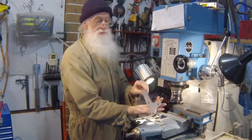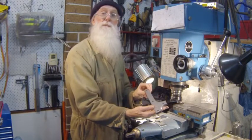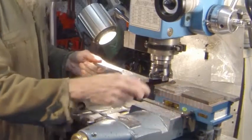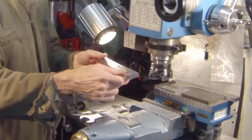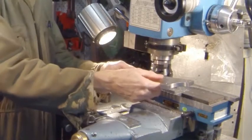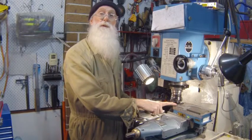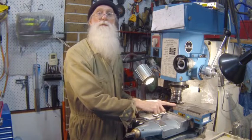As this face is already milled flat, I lapped them on each other with a bit of lapping paste just to make sure any burrs or high spots were taken. Then I just place it on the magnetic chuck, clamp it down, and mill that way. That way you can be sure that it is flat, and it is easier to then just remove the vise and continue on with your work in progress. Now, using a mag chuck, you have to be reasonably intelligent — otherwise natural selection will take care of you.